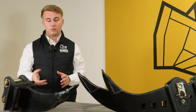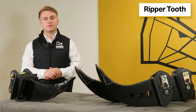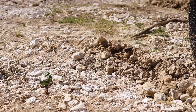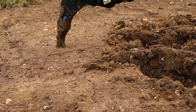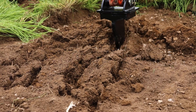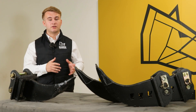When you're up against tough or rocky ground, the ripper tooth is your go-to attachment. The solid steel shank helps break through hard ground and remove stubborn objects. The hardened single point tooth focuses all the force into one spot, making it easier to penetrate compact ground, frozen ground, and even rocks, as well as removing tree roots, boulders, and debris that your bucket just cannot move.